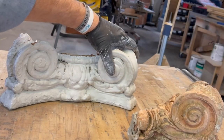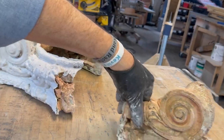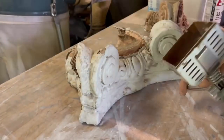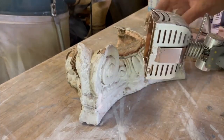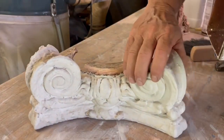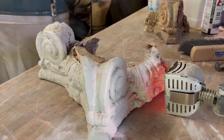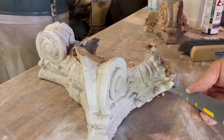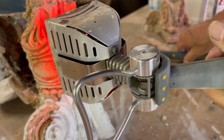It was obvious I needed something much faster and more efficient, and with the stronger paint thinners no longer available, I turned to the Cobra Speed Heater. This tool uses infrared heat to warm up and remove the paint. All I had to do was plug it in, hold the heater over the paint section I wanted to remove for a few seconds, and then I was able to remove the whole piece, large portions of paint, from very detailed sections. It just peeled right out.